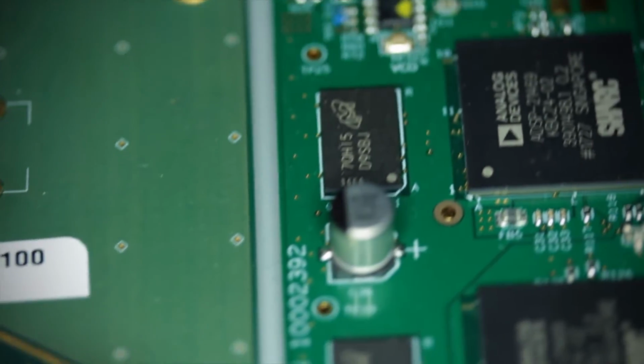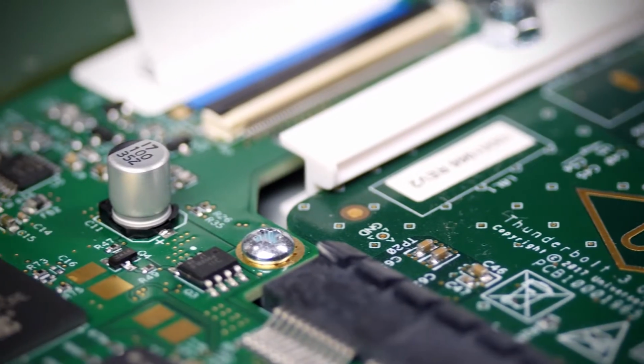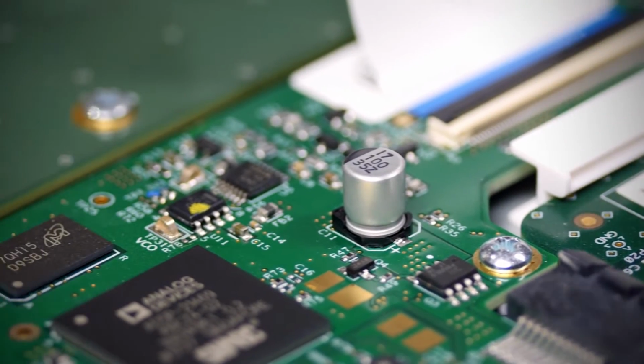So clocking gives you this complete, and in our case, we're using 2 crystals to generate the different sample frequencies, right? Gotcha. In all the digital worlds, we have 44.1, 88.2, 176.4, right?